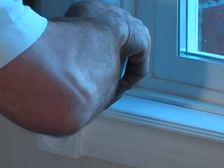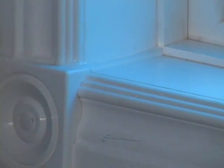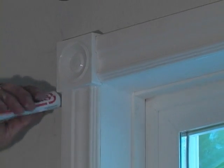Use your Stelmax in the corners and around the rosette cap. Remember, Stelmax dries very quickly and is a very strong adhesive. After applying, gently wipe with your finger. Let dry 1/2 hour. Repeat this procedure on all 4 corners and on the insides of your 45s.